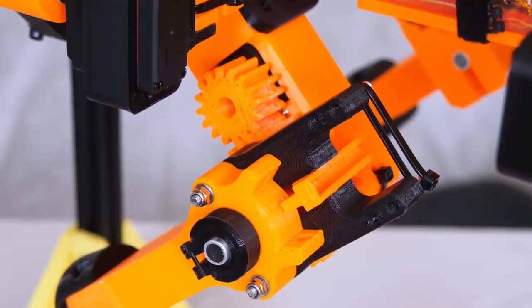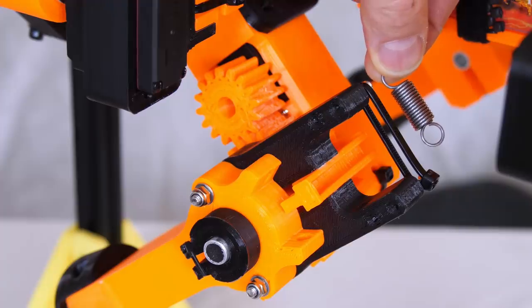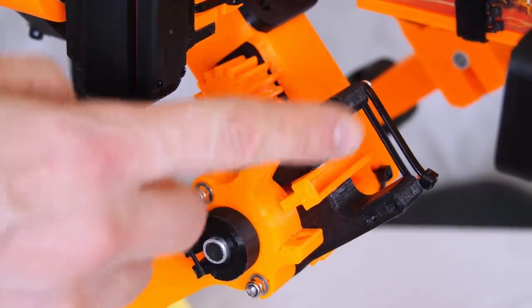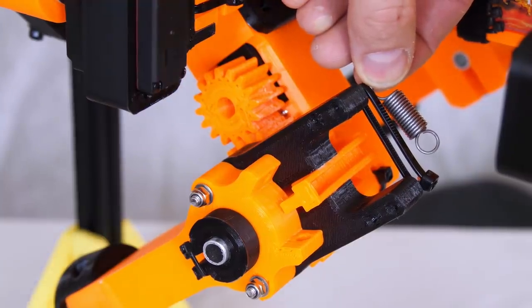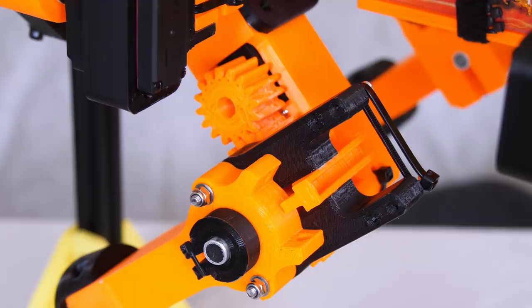And yes, for those of you watching closely, I zip-tied out the springs again, because that's the only way I could get it to work. So the idea was to have these compliant joints with these fingers, and in fact have magnets and Hall effect sensors, which I haven't installed either, which should have made that joint actively compliant. So we've actually taken those out this time so the legs are rigid enough, because unless it's going to move much faster, that compliance probably isn't going to help me. It just means the robot's walking on springs that makes it really unpredictable.